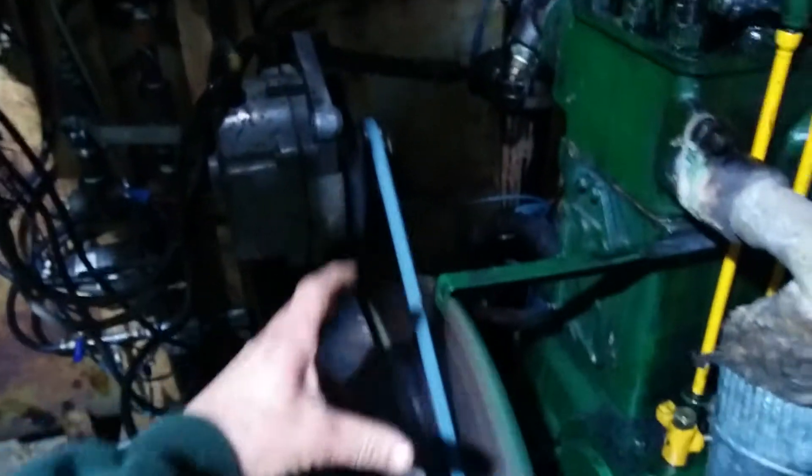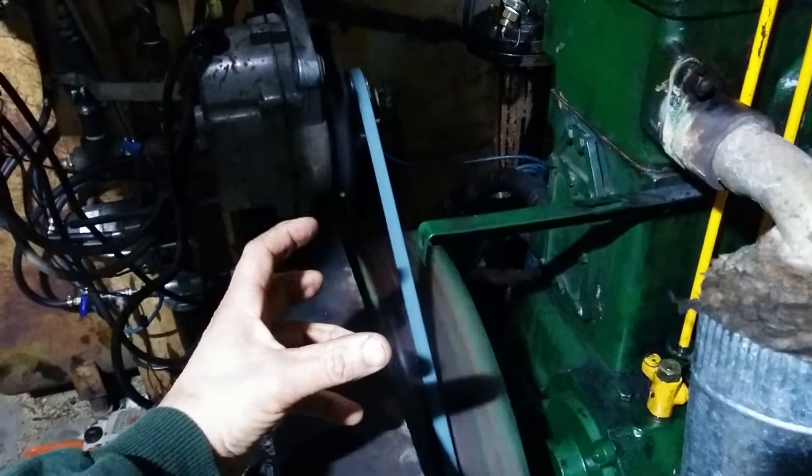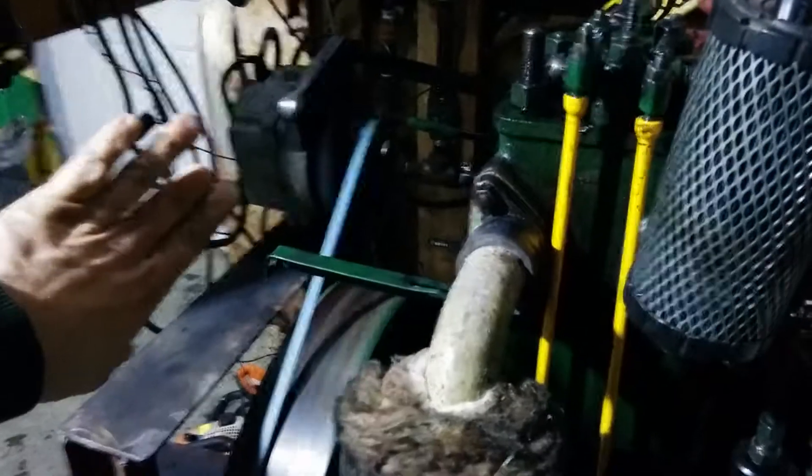Still cleaning up my wiring and fitting up my pipes. I want to put another alternator here — a second 48 volt one — so if something's wrong I can just switch the belt. This alternator over here is the 12 volt one that excites the fields on that one. I'm going to take it off and put it over here also, so all my belts are over there, and then I can build a guard so nobody gets hurt.